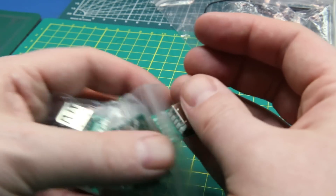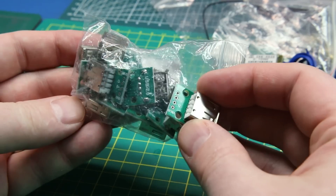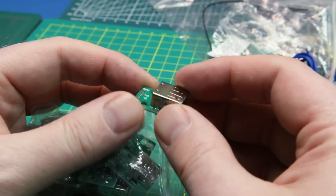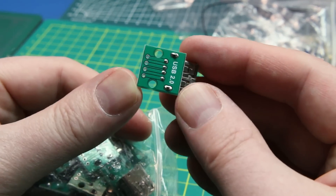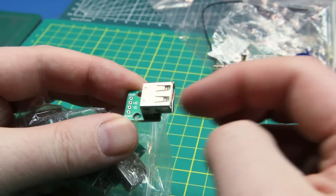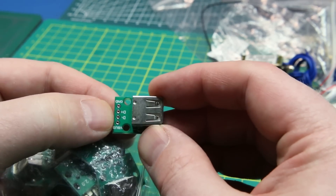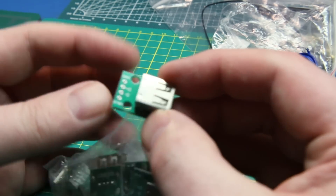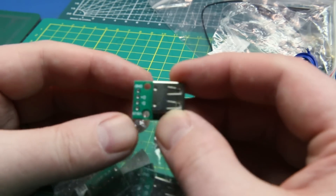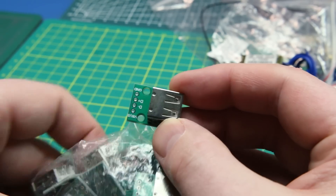Next up some USB connections — these are just USB breakouts, a whole package of them. They're a USB daughter board, USB 2.0 on a PCB, and we can break out USB and hook into our microcontroller circuits. Or you could use them as probe points — hook up a couple of these and put your logic analyzer on whatever project you've got on the go. Should be neat.